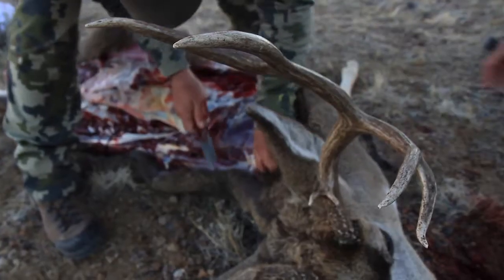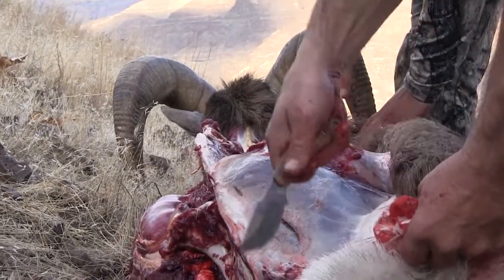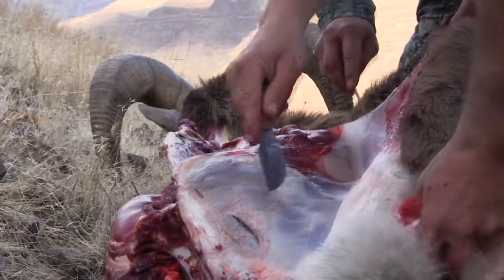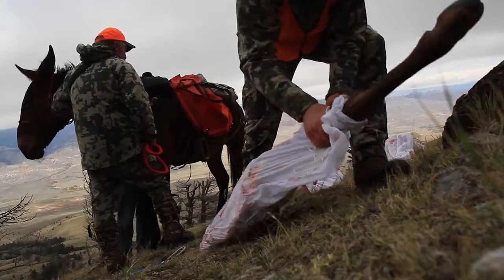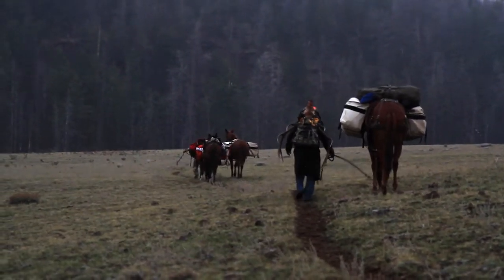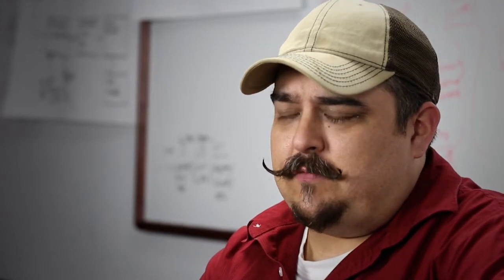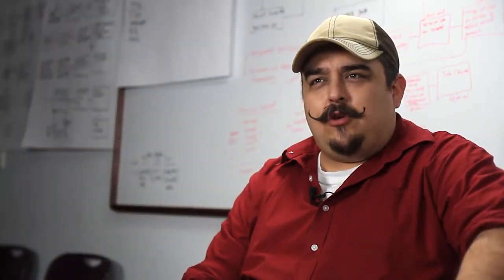S30V is a good choice when you need a balance of all the characteristics that make a good knife. It starts sharp and can stay sharp a long time — that edge retention is really important in the field. It's also a pretty durable, tough steel; the edge will resist chipping, resist cracking, especially under side load and lateral pressure. Corrosion resistance is one of the most important aspects — a lot of guys don't have time to oil their knives. A quick wipe on your pants and throw it in your pocket, and it'll be okay. That combined with the durability and edge retention makes it a really good all-around premium steel choice.